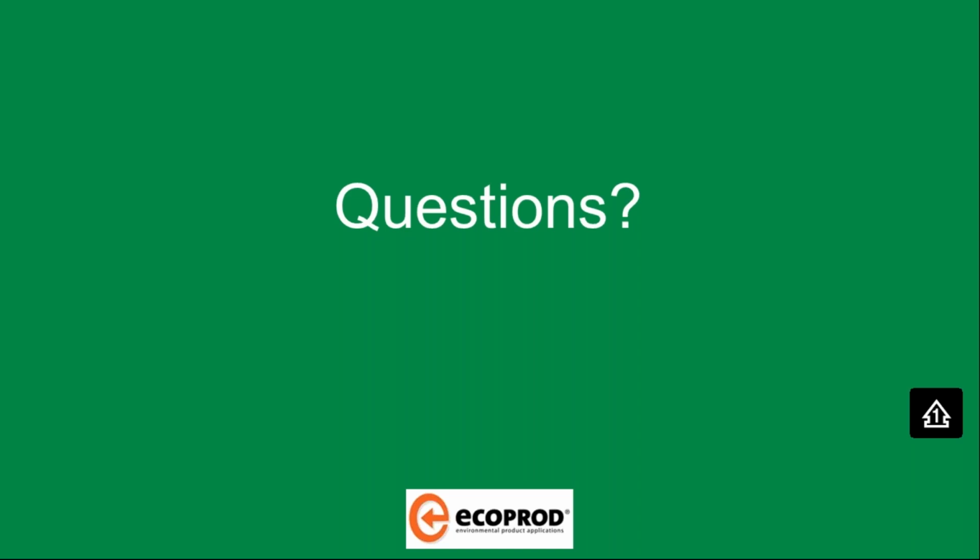Okay, thank you. And the cleaning with the MB Active Cleaner, how often should that cleaning process happen? Well, it needs to happen on a daily basis for every location. For washrooms with higher footfall or different footfall patterns, the cleaning manager, estates manager or property manager would need to make a judgment on that. Some of our high footfall locations that operate nearly 24 hours a day would typically be attended 3 to 4 times over that period. Although the urinal doesn't need to be completely cleaned every time, it certainly needs one good clean during the day. But at those repeat visits, just the inside of the bowl needs spraying with the MB Active Cleaner.